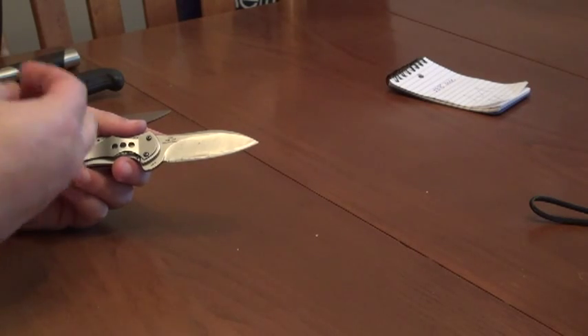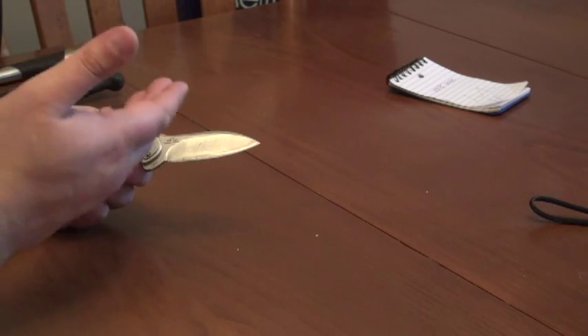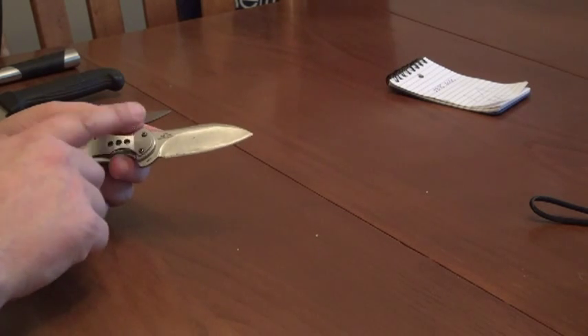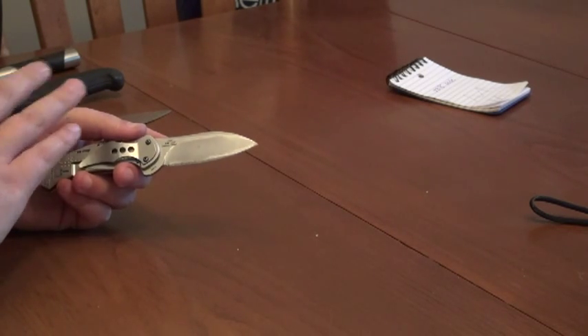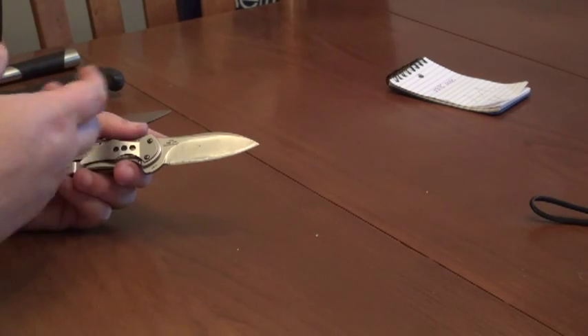You don't get the very crisp edge and high sharpness you would expect from this. Instead, because the level of retained austenite is relatively high, you get a very gummy-type edge. A bit of history: before this knife came out, for about a year or a little bit longer, Roman Landes was on blade forums and a number of other forums speaking about how blade steel should be chosen for knives.